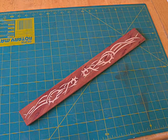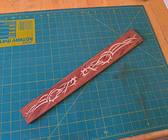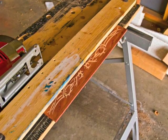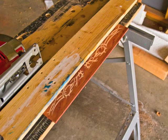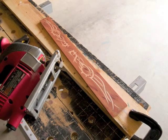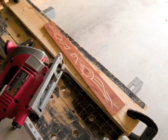To make an electric guitar neck, start by cutting out your fretboard. Use a bandsaw or a jigsaw and be sure to cut just slightly outside the lines. This is how the finished fretboard will look after it's been cut. Now we're ready to add the fret slots.